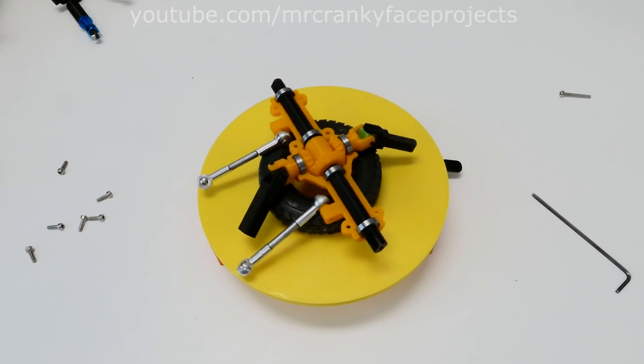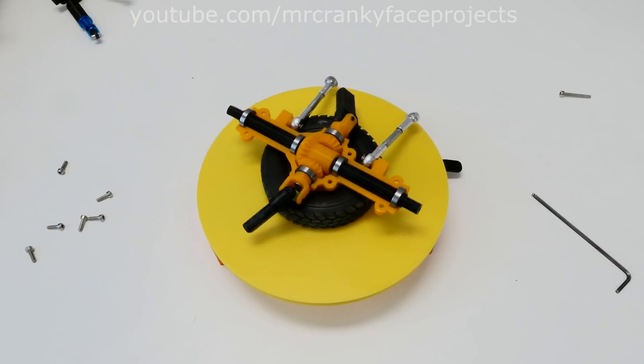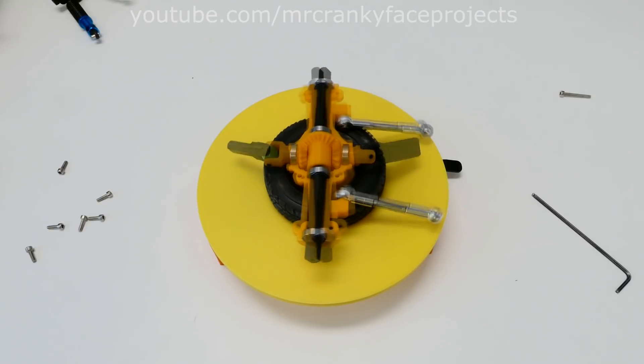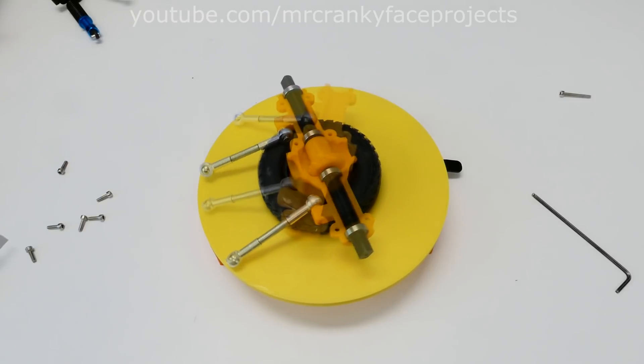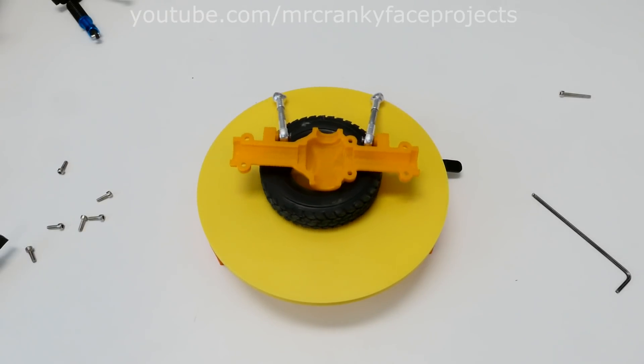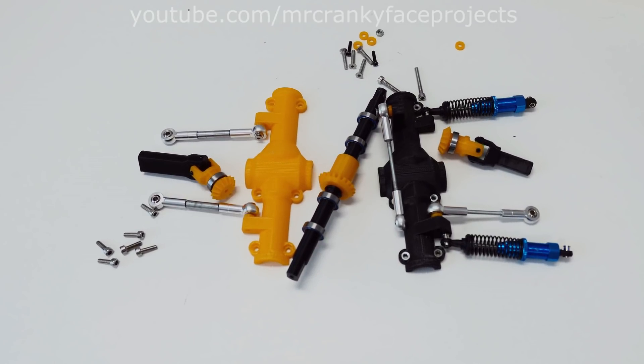This gives a much better ground clearance between the wheels. One downside with this new design is that it's a slightly weaker construction with only one bearing on the pinion gears. This shows up as the U-joint wobbling slightly once the parts start getting worn. It's a worthy sacrifice though since it makes the axles a lot more compact.